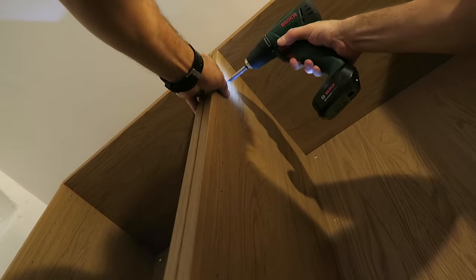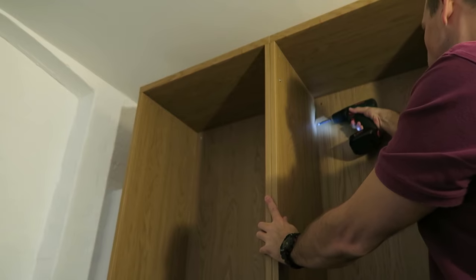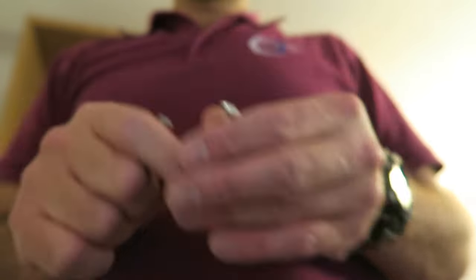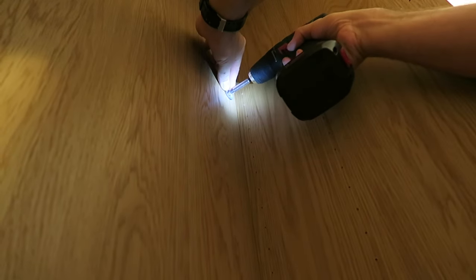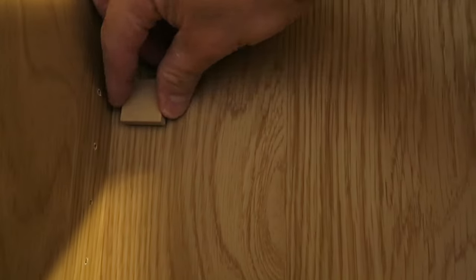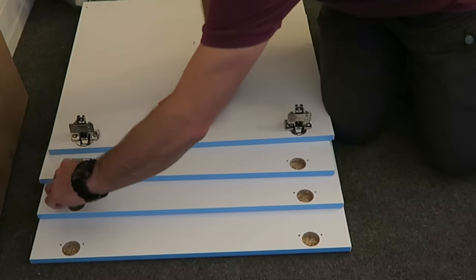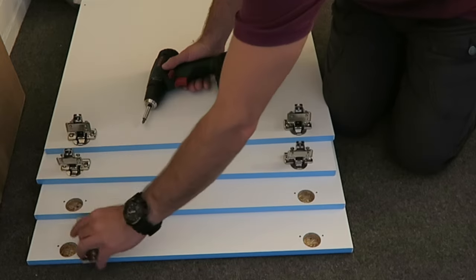We join the frames together with four screws — two on the top and two on the bottom — all the way in, joining the two panels. These are the screws with the washer to secure the unit to the wall. We go in and just secure the screws all the way to the wall. In this case we have a wooden bit at the back so I don't need to drill anything, which is good. Then cover it with the plastic pieces.